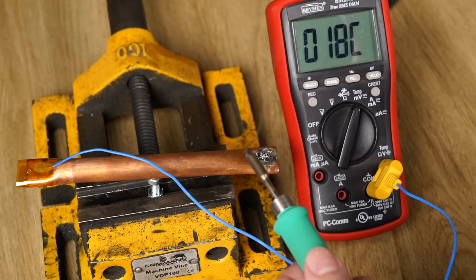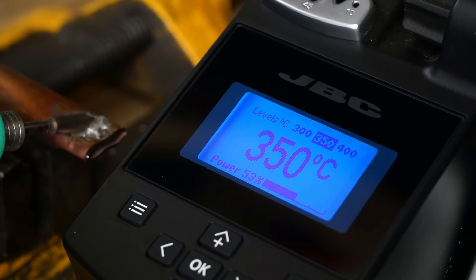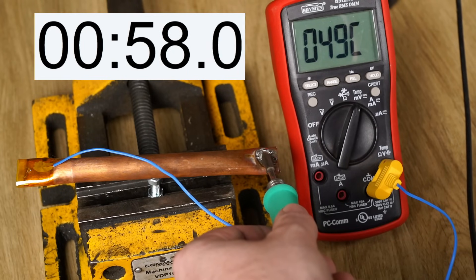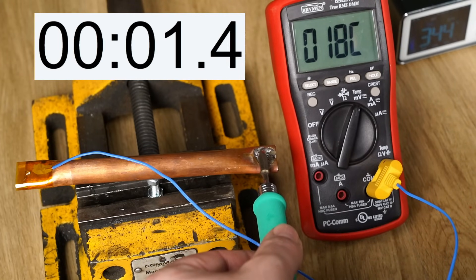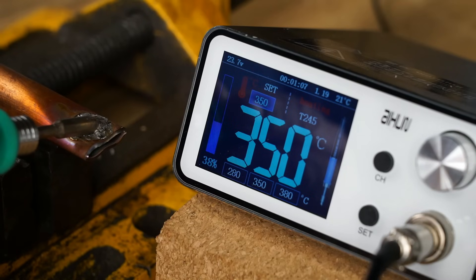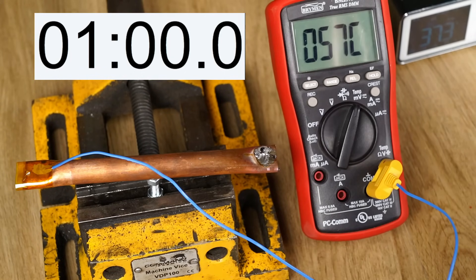Next is the JBC. This is where the JBC flexes all over the previous irons, barely using 50 percent of its maximum power output and maintaining a toasty 350 degrees Celsius, easily melting the solder on the copper tube. Lastly is the T3A — I used the same genuine JBC iron tip for this test to keep a level playing field. The T3A had no problem melting the solder on the tube, and if the power meter is accurate, the station is only using around 30 to 40 percent of its maximum power output. Much to my surprise, at the end of 60 seconds the T3A managed to actually beat the JBC, coming in at 55°C.